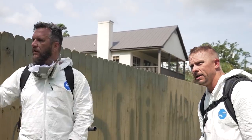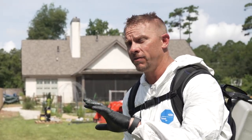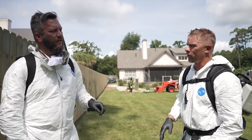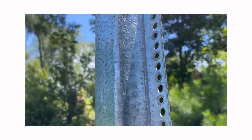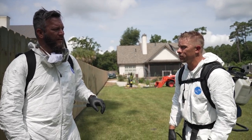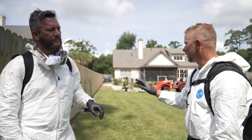There are engineers who design this stuff in labs — these fences are engineered for wind, almost as if they thought they might be in places like Wyoming and Florida where there are hurricanes and high winds. The posts we drove into the ground are galvanized. A lot of people said you can't put a galvanized post in the ground, but galvanized steel is used for pilings, helical piers, and structural supports for buildings and decks.